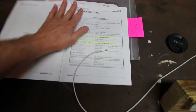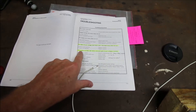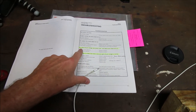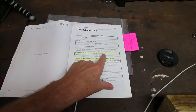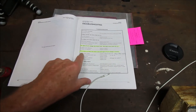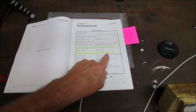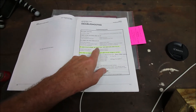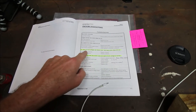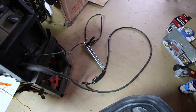The manual has two areas where it says the wire feed motor does not run. It gives you points to look at: no open circuit voltage with the fan motor running, wire feed motor does not run, or wire does not feed with the fan motor running and open circuit voltage present. I know the fan runs and I have no wire motor function, but I'm not sure about the open circuit voltage, so let's check that first.